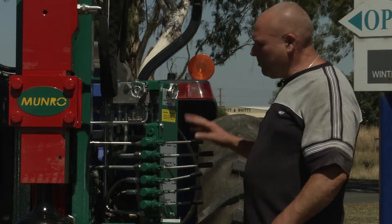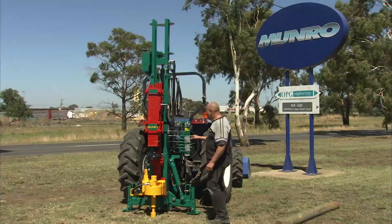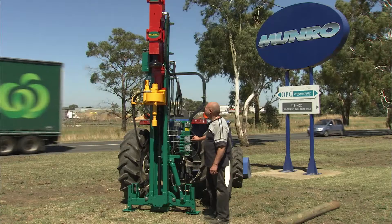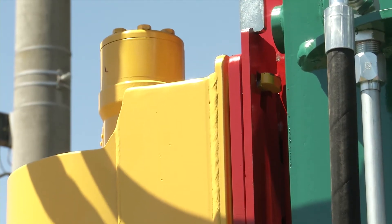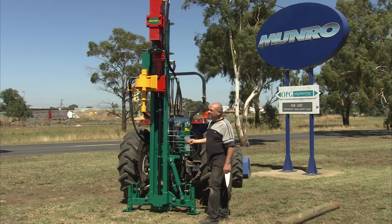To lift the hammer up, first you need to close off the auger feed tap. You put the hammer on function. Once the hammer reaches the top, it will release the digger locking system and the auger control can be used to disengage the digger.